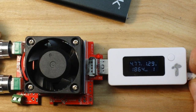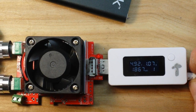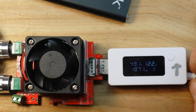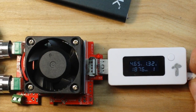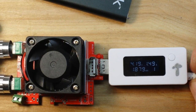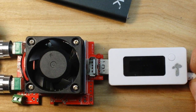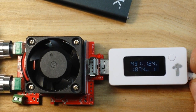Not very far. At 1.07 still good, 1.1 falling a little bit, 1.15, 1.22 and we're down to 4.91 volts. At 1.3 we're down to 4.66 volts, which would probably still charge albeit slowly. Now we're down to 4.2 volts at one and a half amps — and that's it, she died. At about one and a half amps we've reached the total limit of this charger.